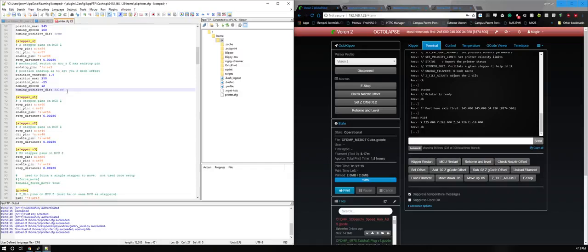These snap action switches, the internal springs inside, change how they operate, the amount of force required, based on their temperature. So with the FSR switch that you guys may or may not know yet, it has been super repeatable. I can do a hot print, cold print, never have to look. I haven't actually looked at a print start in a long time.